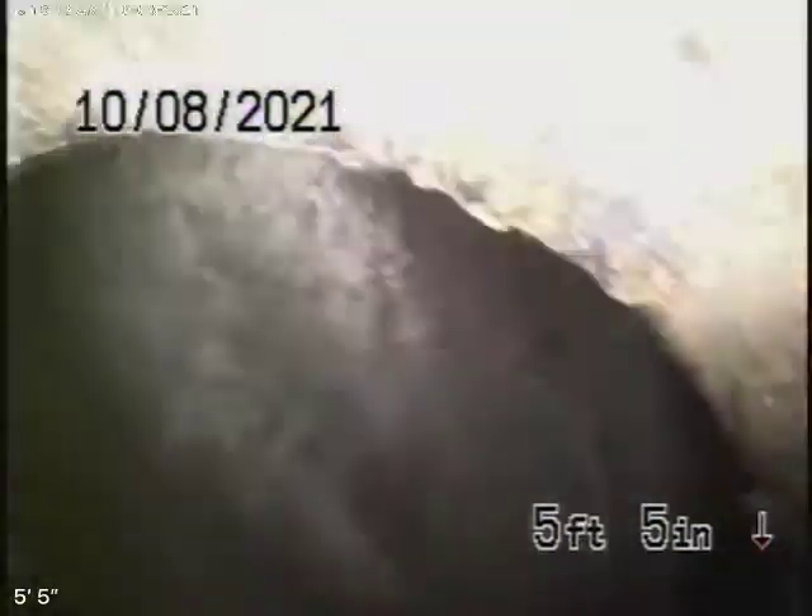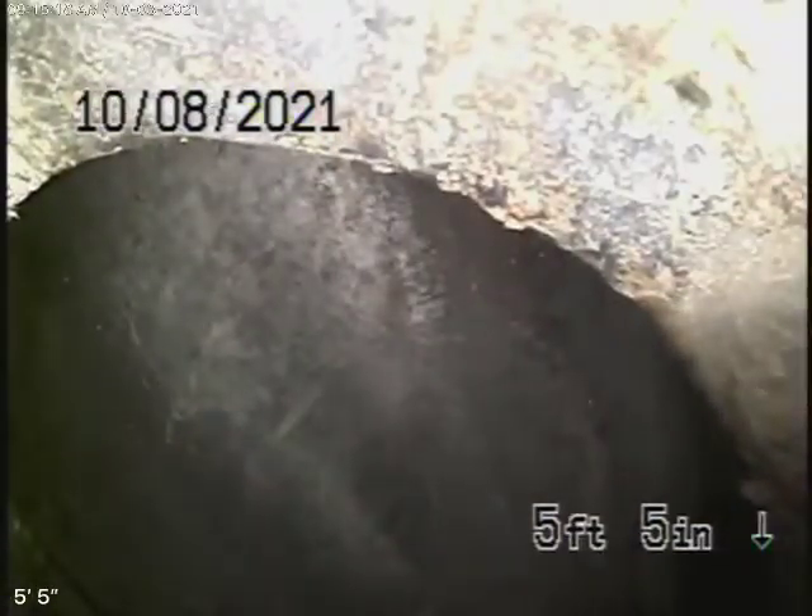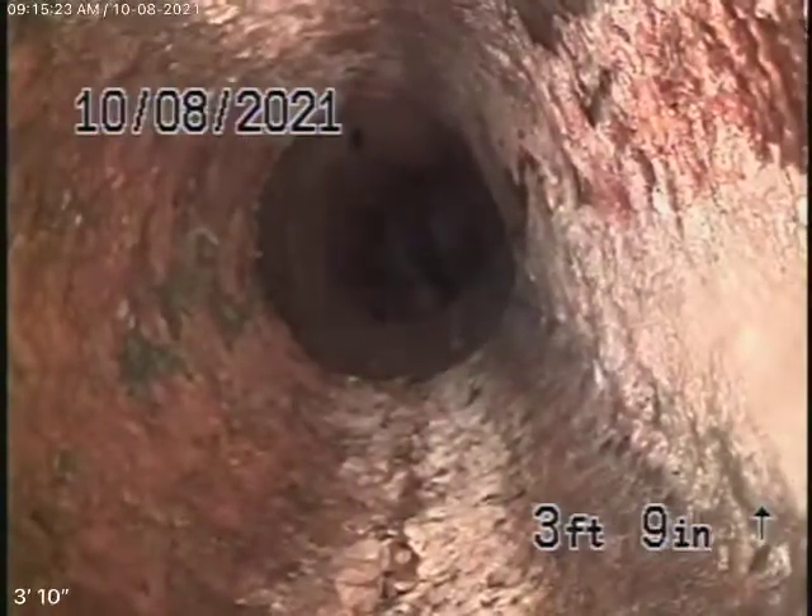Here it's going to turn where the back unit ties in. That's where the back unit ties in, with the main line going underneath the driveway. There's a little section of cast iron pipe over here. In my opinion, this looks pretty good — it's still nice and round. As we come out of the clean-out here, we're going to pause the recording.